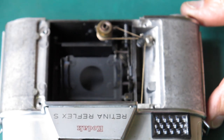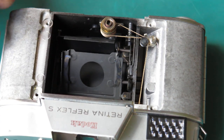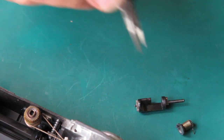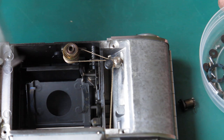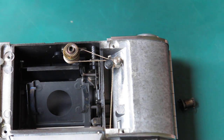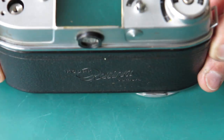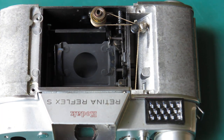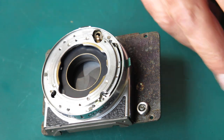There are a couple of tasks I'll need to do before I'm ready to put the front back on this camera. One is to put the shaft back in position, and the front pinion, and tension up the spring on the front pinion. The other thing I'll need to do is place my washers. Since I'm not ready to do that just at the moment, we'll leave this camera as it is, pop the body to one side, and deal with the other major component — which is the front of the camera with the shutter assembly on it.